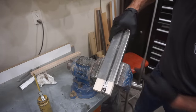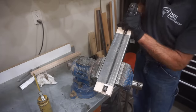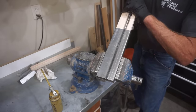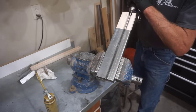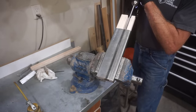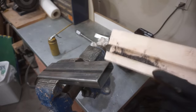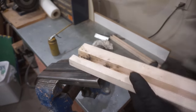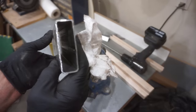For the sake of experimentation, I'll try to cut the weld seam out of the rectangular block by using a stationary jacket and pulling the Seams Impossible tool through it. I'm thinking this might be the go-to method for relatively short pieces of tube because it saves the trouble of piloting, counter boring, and screwing the jacket to the block. I quickly learned that you've got to make sure the extension is firmly chucked to the cutter or it'll come off in the process. I'm getting some remarkable cutting action, and it's just cool to see that whole weld seam piled up in the bottom of the jacket as a little pile of shavings. An added benefit of pulling the tool through the jacket is that the cut can be made all the way out the back end of the tube, saving an extra step of grinding at the end.